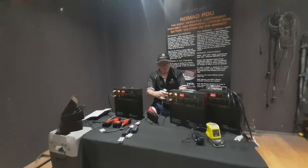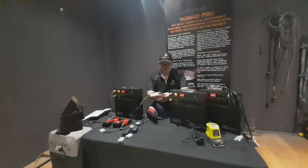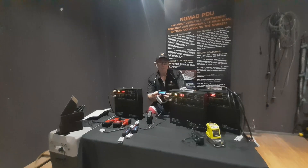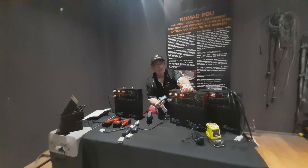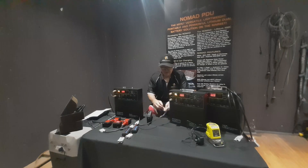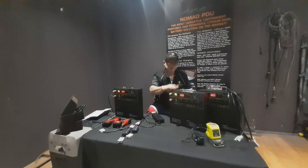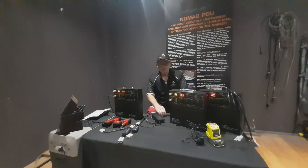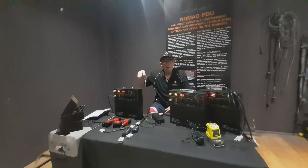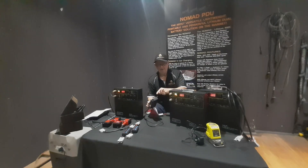I know this charger is faulty, which is why I've used it. I'm going to plug into source, and what that does is tell me how much voltage is coming out of this charger — it's showing 12.2. There can be a one-point difference on an LED screen, so it might say 12.2 or 12.1. I know this charger is faulty so it needs to be replaced, but you can still use it — you just have to realize it's only going to get the unit to 12.2. To confirm it's not the unit, you can plug in a DC/DC charger or a solar panel and see if it gets a full charge — if it does, you've eliminated the unit and it's more than likely the charger.